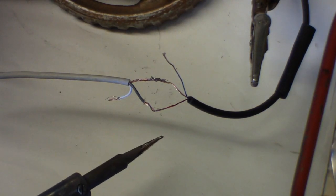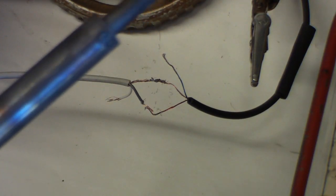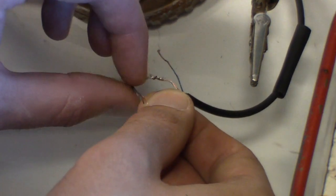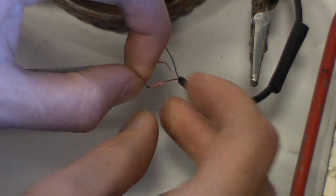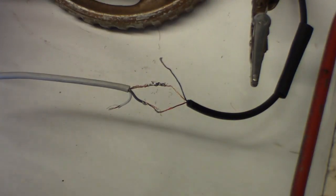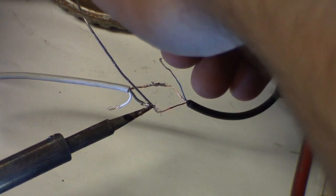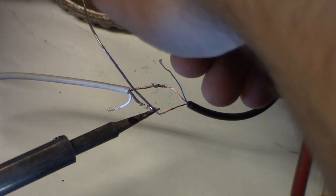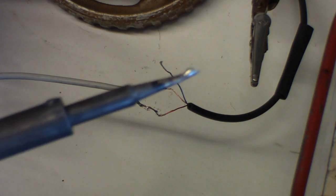Get some solder, get it under the wire — oh yeah, that can happen sometimes; the wrapping just got undone so I've got to try to rewrap the wire together. It's kind of hard to do this with gloves. That's why I don't tin the wires first. You want to touch solder to the wire and have it melt on the wire, not just melt on the iron — that's part of the skill.